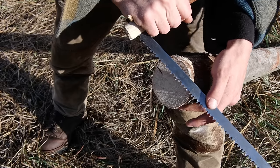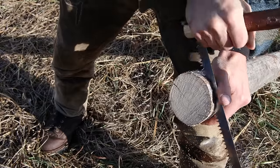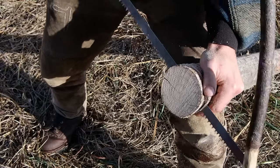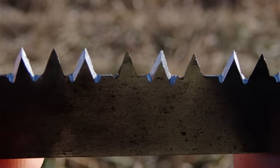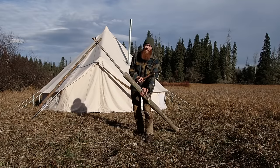Those teeth bite in really, really nice — they're not skating across the surface anymore. You can really tell they want to bite into that wood. Those teeth are good and sharp. Big difference in the cut: there's no rattling or vibration sound, the saw is cutting cleanly through the wood, I don't have to push super hard to force the blade through, and the sawdust is no longer really fine dust — we're actually getting some bigger wood chips out. That is exactly what you want from your saw. So there we have it: a really simple way to sharpen your saw using just a file. You don't have to carry any expensive or elaborate tools — just one little file and you can touch up these teeth and make a big difference in how it cuts. So now I can stay busy bucking up wood for my little stove and make sure I'm staying warm at night. Really appreciate you watching and I'll see you in the next one.